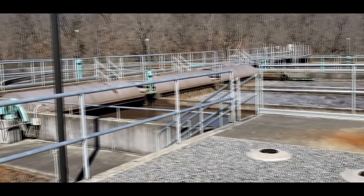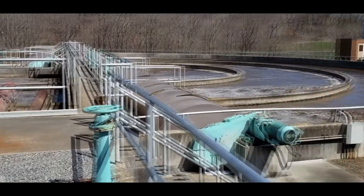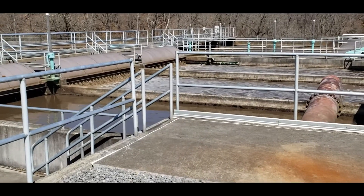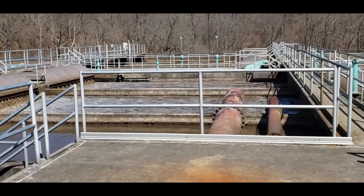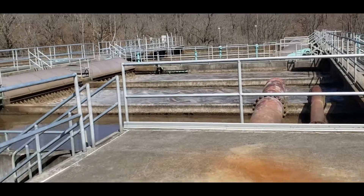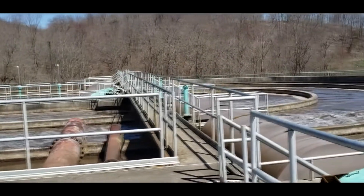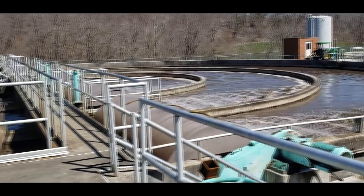You can see the aeration. Everything comes in and comes in on this ring. So the outer ring here is the first stage of the bacteria beginning to break down the organic matter, and then over time it works farther and farther to the center ring. Whatever comes in here is pushing that much out to the second ring, which is pushing it out through the third ring. The outside ring is about equal in volume to the inner two rings.